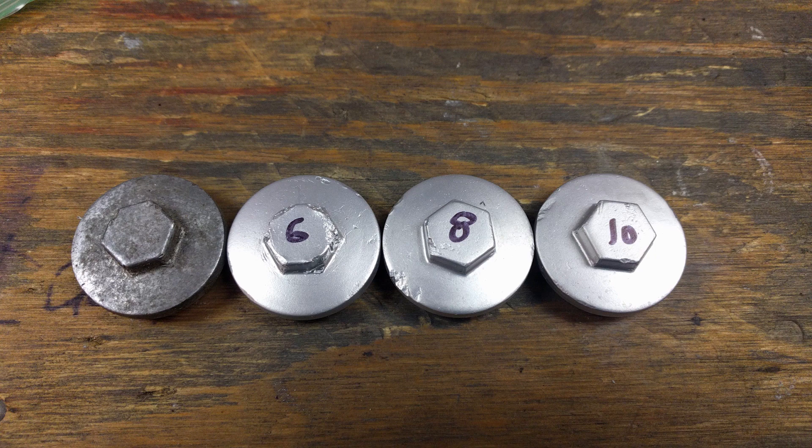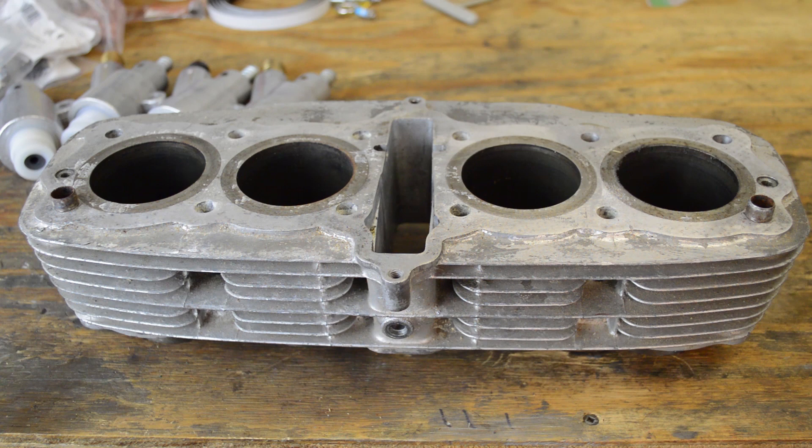Here are a few parts for comparison: all the way on the left is a before shot, then to the right of that is labeled 6 — that's the 6 CFM gun result — then 8 CFM, then 10 CFM. You get good results with all of them. The number 6 part is a little shinier, but that's just because I had a little more time to blast it. Next up, since I ran out of tappets, here's the part we're doing further testing on: a CB550 cylinder block with factory paint and 40 years of corrosion — a really nasty part.